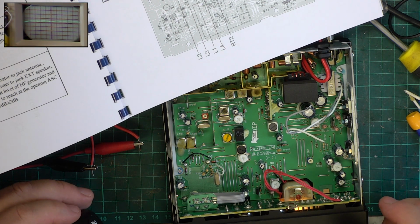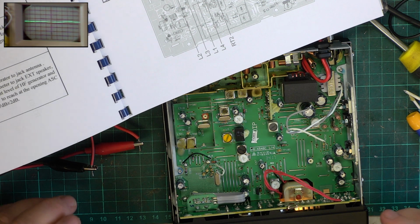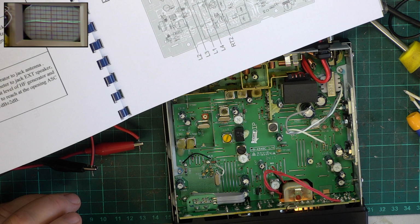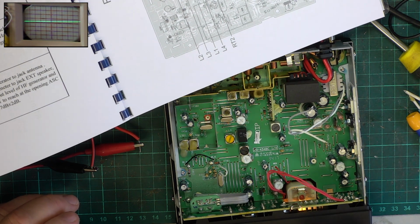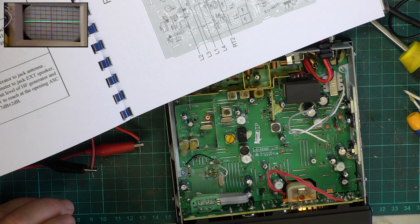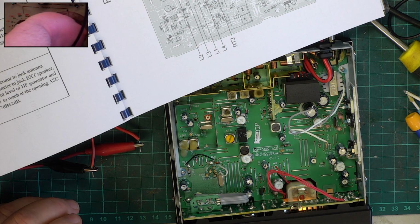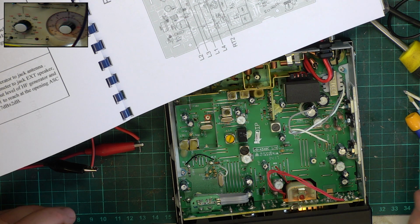Right, Squelch, RT401 Auto Squelch. Let's see how that's working. So I like Auto Squelch to come in somewhere around about 3 microvolts. So let's turn our attenuator. So 0.3, 1 microvolt, 3 microvolts. That's ideal. So look at the fine tuning. It's coming in at 2.8 microvolts, and it's dropping off at 1.6 microvolts. So that can stay put.